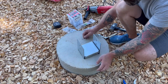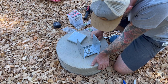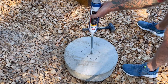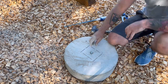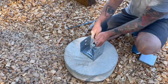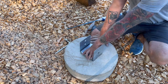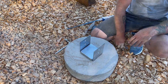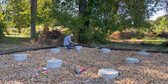After drilling I needed to clean the holes of dust and debris, so I used a little hole brush from the big box store — it worked pretty well to wiggle all that dust out. Next I used Simpson Strong Tie concrete adhesive to set the anchors, and took a sledgehammer and started pounding them in. If you do it right you should get just a little squeeze-out of adhesive at the base of the anchor. Then you put your post base on there with the little square washer, and I also added the washer from the concrete anchor and used a socket to really tighten the nut down. In no time I had all the post bases securely in place — after drilling 13 more holes.